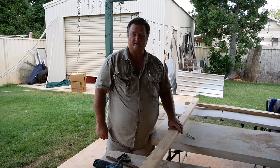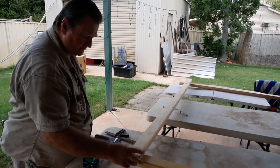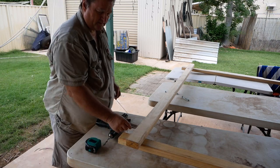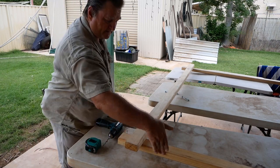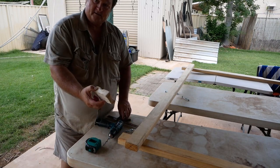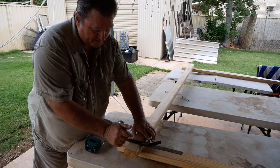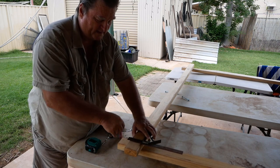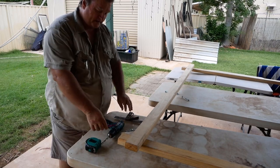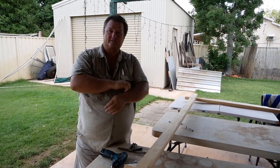So I go out to the yard and mark everything up. I put the spacer on and mark it. That goes to the edge, which gives me the overflow I need. Even though I'm using the sponge spacer, I still come back and use my square to make sure everything is properly squared up, because if it's off you can end up with a frame that sits crooked.